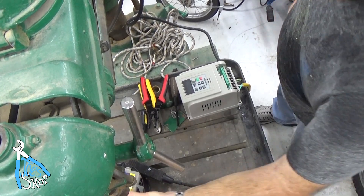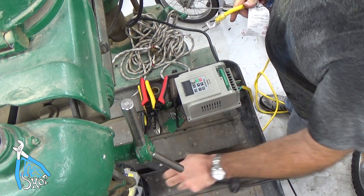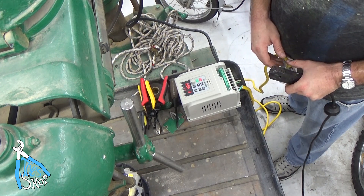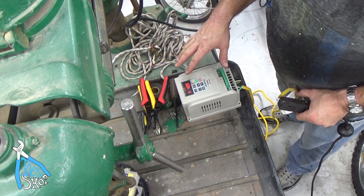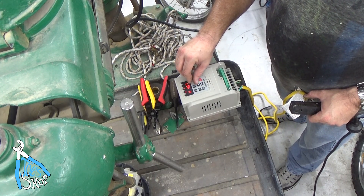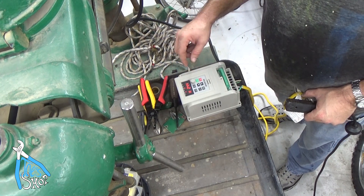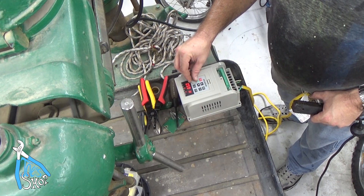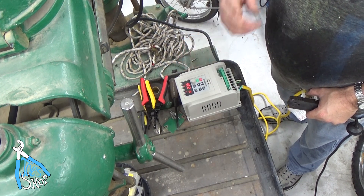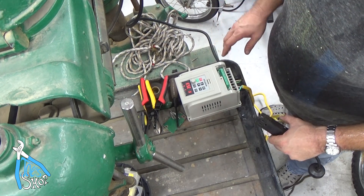You've got a bird's-eye view of what I've got temporarily wired up here, which is just the power — 110 volts in, and it should be 220 out. Hopefully it works. Now the instructions are horrible — they didn't have anything in terms of how to program this. Look at that, it works! These are the hertz, you can see the 24 — it's probably flashing for you. Up to 65 hertz. Stop. Reverse. Run. Reverse. Well, that's perfect.